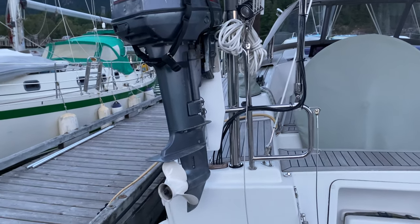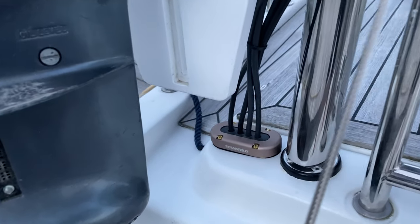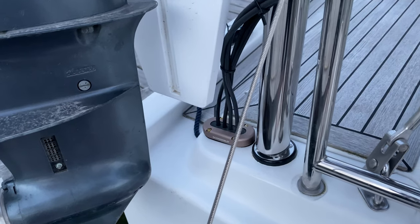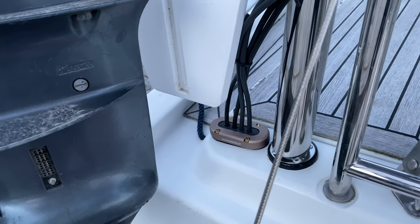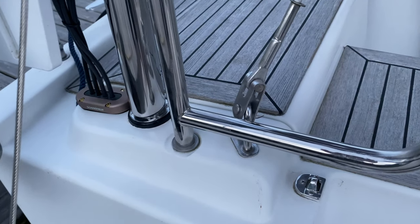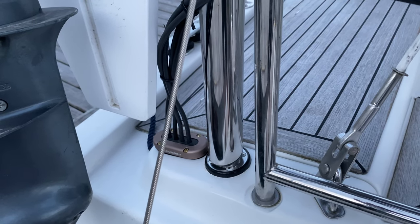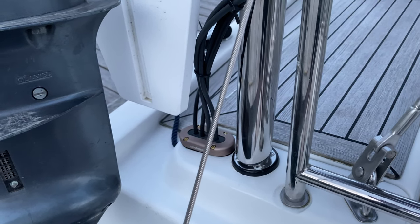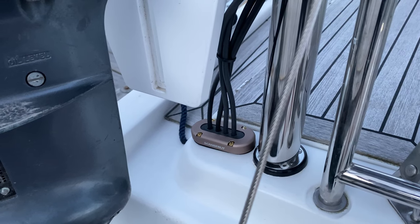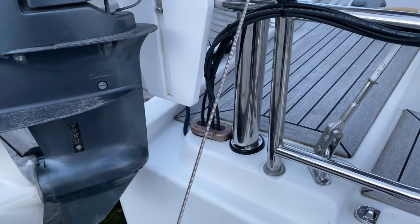Before it all runs down onto the cable clamp - and here is the cable clamp. It was a little tricky drilling for that; it's quite a thick spot, maybe an inch plus. It's uber strong because it has to accommodate the backstay, and there's actually an aluminum plate in there as well, but I was able to drill through it. This little cable clam is pretty cool - though tough to pull the wires through the rubber gasket due to friction, which is actually a good thing because that's what makes it waterproof. It looks great and does the trick.